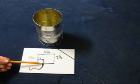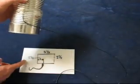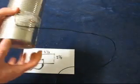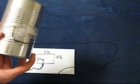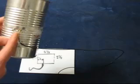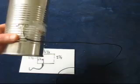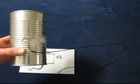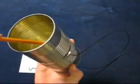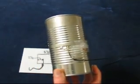First you want to drill a hole in the can 2.5 inches from the closed end, which is the back end here. Next you want to strip the insulation off the antenna wire so you expose the shield conductor and the center conductor. Next take the piece of copper wire and solder it onto the end of the center conductor.